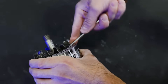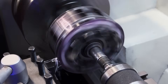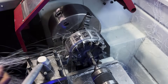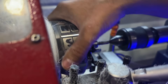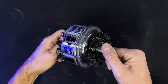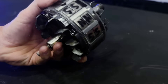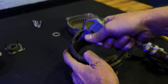We will bend the blades slightly to extract all the plastic. We will then machine the rotor on a lathe to achieve the exact dimensions and ensure it is fully balanced to prevent vibrations. We will reposition the blades correctly, and this is the magnificent result.